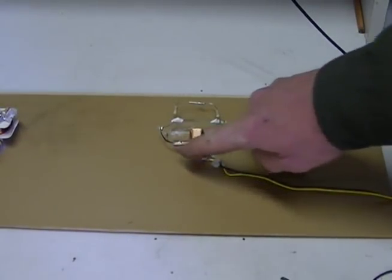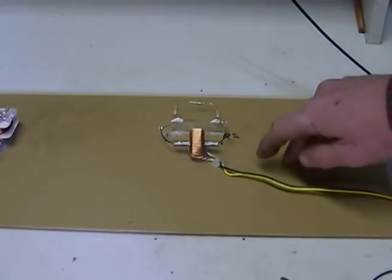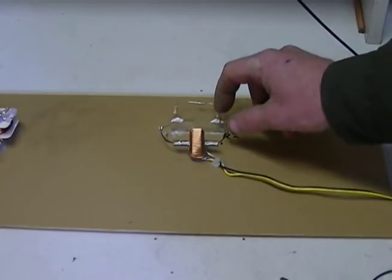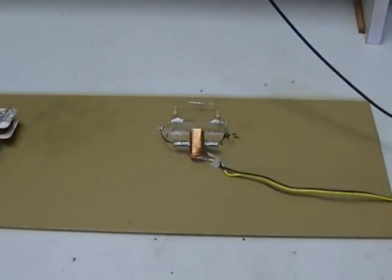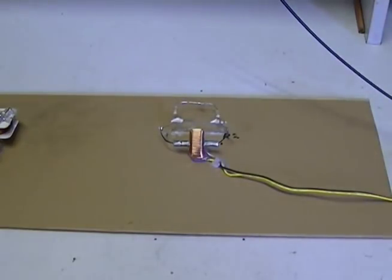One: induction doesn't only take place on the small piece of wire travelling through our toroid core. It is induced by the electric field through the whole circuit, and there only has to be one short piece of that circuit in that electric field to obtain the same voltages throughout the circuit. Oddly enough, that's how it is. We have also eliminated the fact that you can't simply loop around the toroid, because you are now introducing a second circuit which you are measuring the voltage across and not the circuit we are looking at. If anyone can see any mistakes I have made, please feel free to tell me and we will correct those mistakes. Thanks for watching.